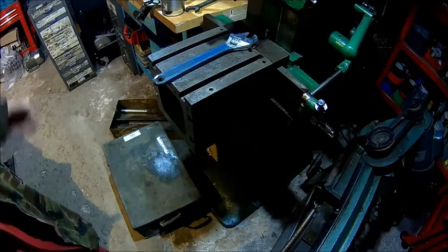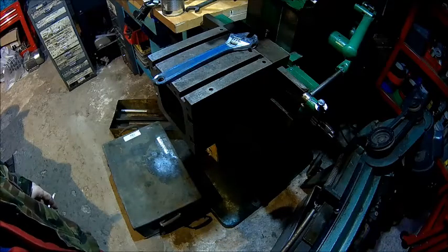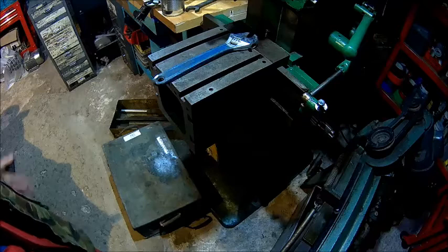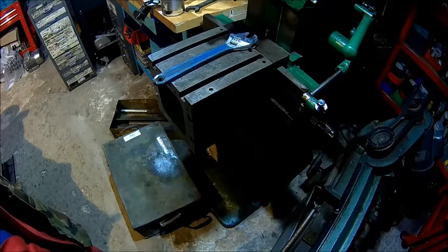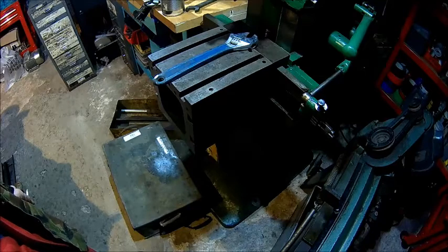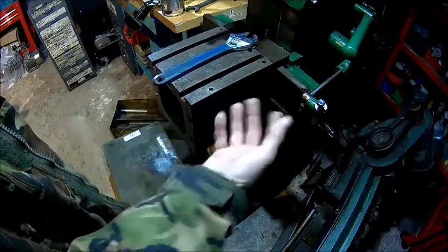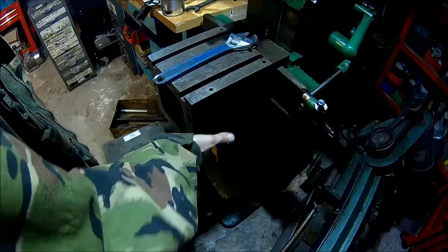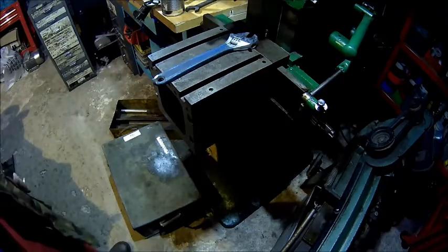On the shaper it's different because it only moves when there's no pressure, on the return stroke. For a milling machine, always consider your tool pressure because that goes on top of the spindle torque. If you know the pitch of the spindle and your feed rate you can probably figure it out. On this machine it lifts the whole assembly, which is heavy, and there's just a bushing so there's a lot of friction. If you lift the table it's easier, but it's an 80-year-old machine — that's how it's designed.